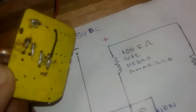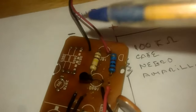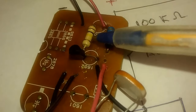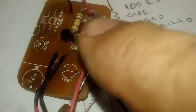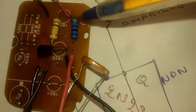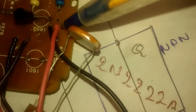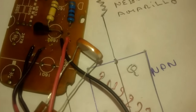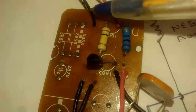You can see them bridged — the positive line picks up both resistors. The 100K resistor goes directly to the transistor base, which is in the middle pin. The 100-ohm resistor goes directly to the positive of the LED. Here is the LED, but this cable is an extension to connect the LED in position in the lamp rather than on the board itself. That covers everything related to the positive line.